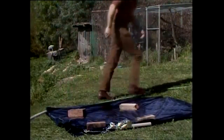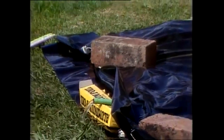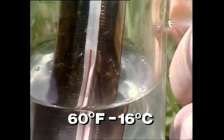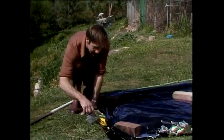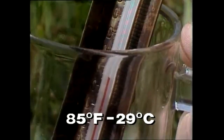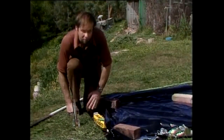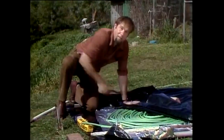We'll give it about five minutes. Here's tap water — sitting at about 60 degrees, which is the temperature going into the hose. Let's dump that and see what's coming out. Oh, quite a difference! I'll collect some and put the thermometer in — the temperature rockets up: 70, 80, somewhere between 80 and 90 degrees. So that's about a 30-degree increase in just seven minutes. If we left it for half an hour or an hour it would get very much hotter. With about two to three hose lengths in there, you'd have quite a decent volume of water being heated up with free solar energy.